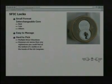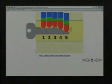Question? Oh, yeah. I can explain this later. This would be considered maybe a key that would work on one floor of a dorm room for like an RA who has an RA's key. Because maybe this combination of master pin stacks is unique to this hall, but he only has these pins across the board. These aren't going to work elsewhere.